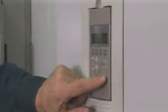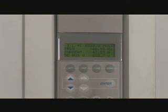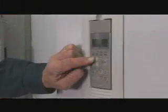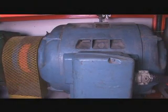The VFD motor is mechanically connected via its drive shaft to an identical squirrel cage induction motor here. The VFD is started up and set to run at 60 Hz. Once the motor is up to speed, we will take the other motor and switch it to the line using this start button here. If we increase the speed of the VFD motor to about 63 Hz, we will also increase the speed of the driven motor, which will become a line-excited induction generator and provide a load for the VFD and motor. This setup allows us to test the VFD and our lineators at full load.